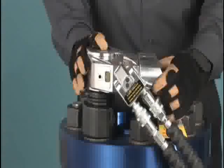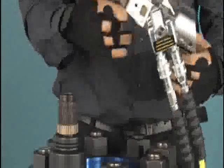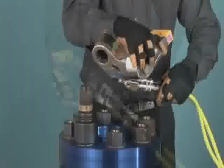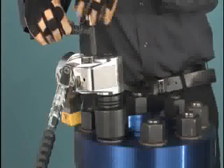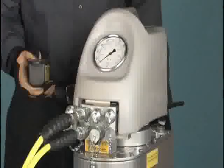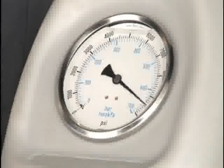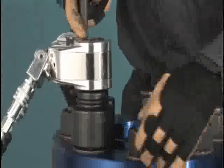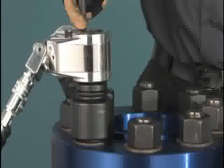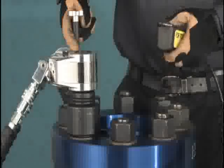When removing a nut or bolt, we are not concerned with an exact torque value, only that our tool has sufficient power to break it loose. Reverse the direction of the tool, whether a square drive or narrow clearance dial, as we discussed before. Turn the pressure up on the pump to at or near 10,000 PSI, giving the wrench its full power. Fit the wrench, once again checking the reaction point, the socket, and the hoses for proper position. Bump the button and observe the wrench to make sure it is secure.